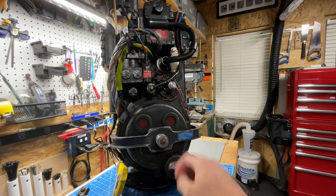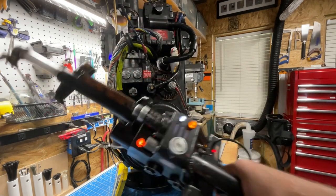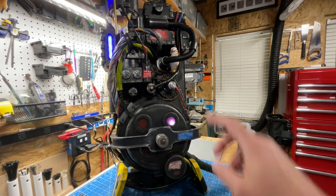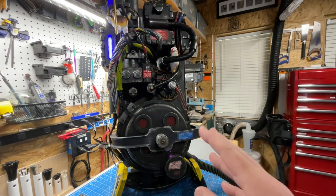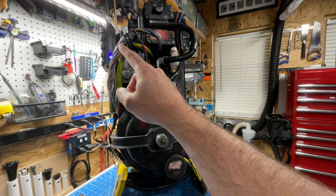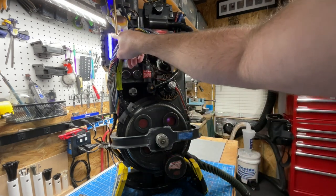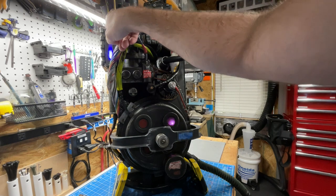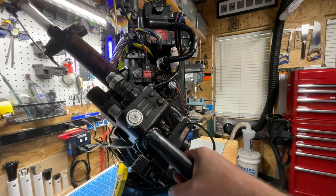Let's fire everything up. Right now we've already got a few glitches — you can see a blinking white light at the top of the power cell. That's because the software's stock configuration is set to work with the HasLab hardware: a 13-LED power cell with a 12-LED cyclotron lid. There's glitching because the software thinks those extra LEDs are part of the cyclotron. It goes one through 13, and the next LED in sequence it thinks is down here. We need to change that, so I'm going to turn off the wand and turn off the pack.